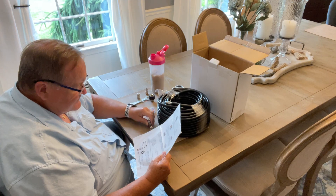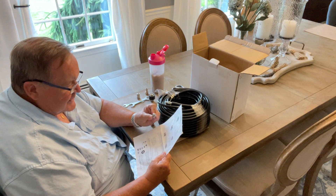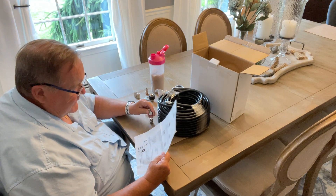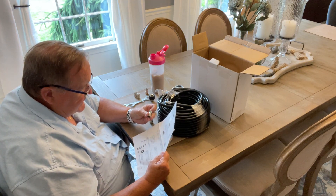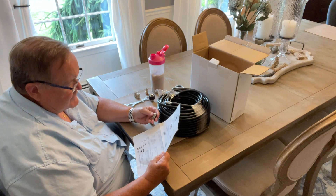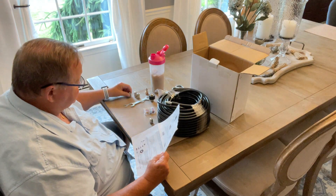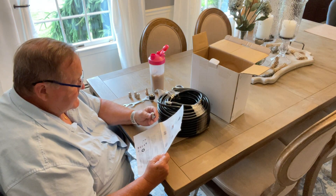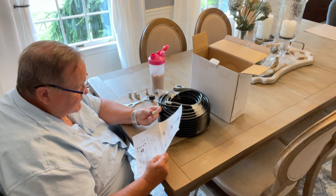This next one is called a ball head. It has one front jet and three rear jets — that's the one I showed you first. Then there's a side spray nozzle, and this has three rear jets and what they call a corner jet, so this will be used to flush out a blocked pipe. And this is called a one-rear-three ball head, which just has three nozzles around the outside and one in the front — it's suitable for corner cleaning.